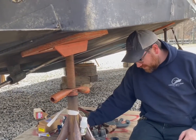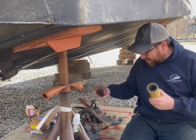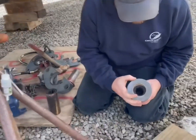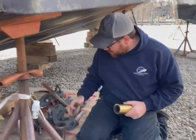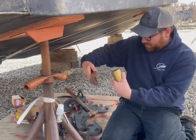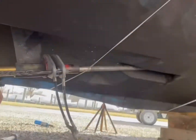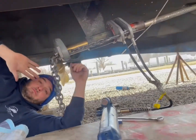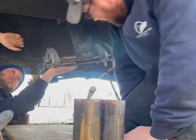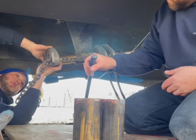We're going to get this set up now and show you how we press the bearing back in. Basically we just flip everything backwards and use a slightly smaller ring to press it in. Obviously the larger ring won't fit like that, so it's going to pull on the bearing and pull it right in. Instead of using the press to push it out, we're pressing against the strut to pull the bearing into place. We've got the Durant press set up here — make sure the angle's good. The red piece is flipped backwards using a smaller ring, and it should go in nice and easy.